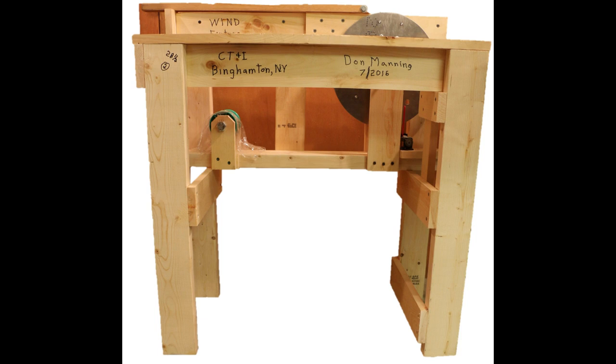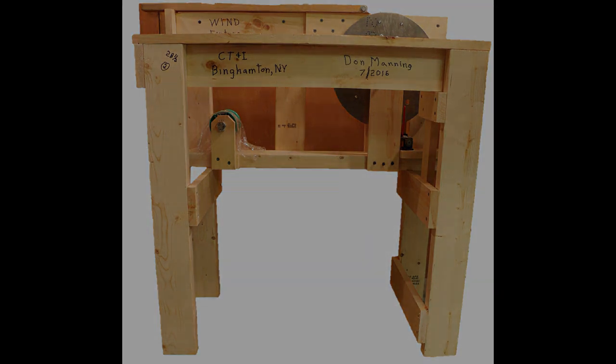In reality, for the width of the band, which was about a quarter of an inch, we couldn't put as many 4/1000th diameter wires in the strand. This is a continual band of wire. It simply is wound on, and with 3/1000th wire, it was probably around 60 turns of wire. With the 4/1000th, we were down closer to 50 turns of wire. From a stress standpoint, the 4/1000th wire with fewer fibers was actually stronger than the 3/1000th diameter version. But there's more stress on the wire as it goes around each end of the cartridge, so there's maybe a fatigue problem involved over time. Otherwise, we used the 4/1000th and it seemed to work fine.